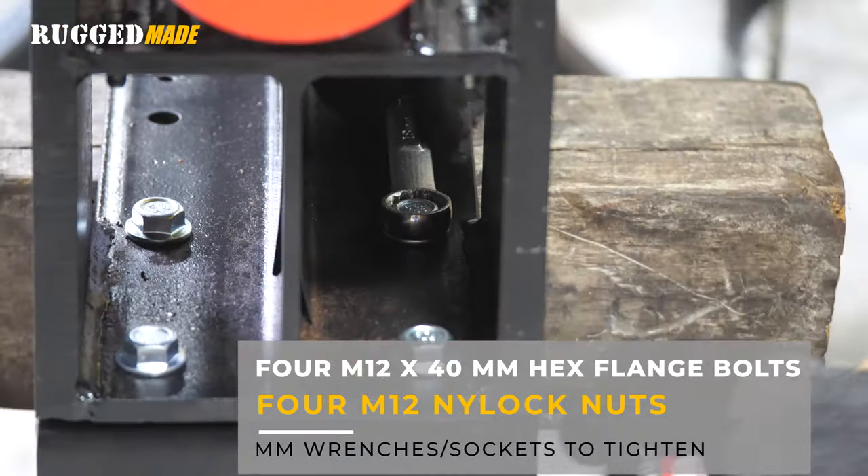Put a little bit of Loctite on the bolts. The heads of these bolts take a 13 millimeter wrench — get it nice and snug, but we don't need to over tighten since we've got the Loctite. Keep in mind you've got steel bolts going into cast aluminum. On the 300 series, the pump orientation should have the suction nipple pointed down and the high pressure port facing up. Again, we've got a key — a screwdriver or similar tool can be useful to keep this key from getting pushed out of position as we slide it into the jaw coupler.